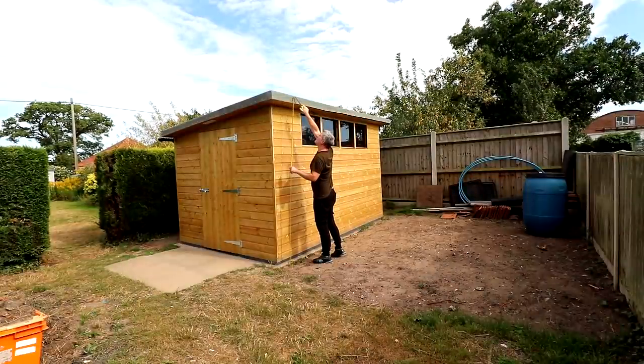Another question: did I need planning permission to build the shed? No — or at least I don't think so. I'm pretty sure this is well within permitted development, especially as it's basically replicating what was previously there. Based on my limited knowledge, if the shed is within two meters of the boundary of the garden — which mine is — and the maximum height is less than 2.5 meters, then it's fine. Let's just measure up and check.